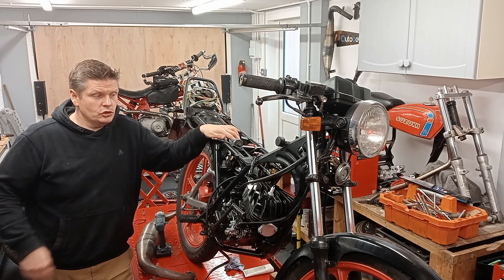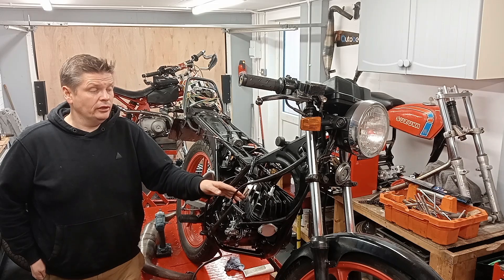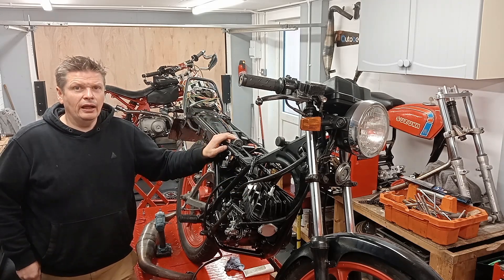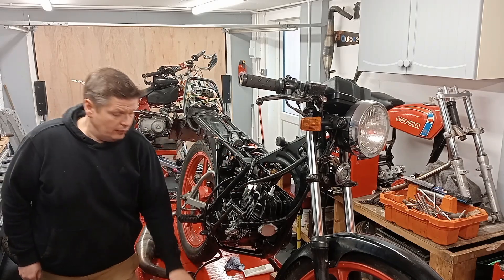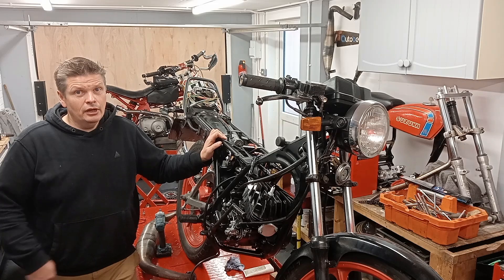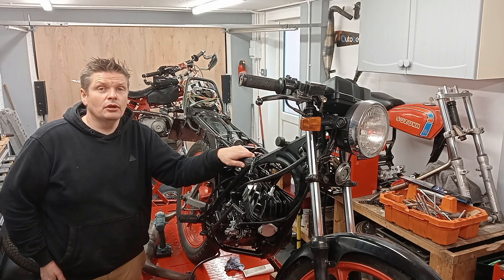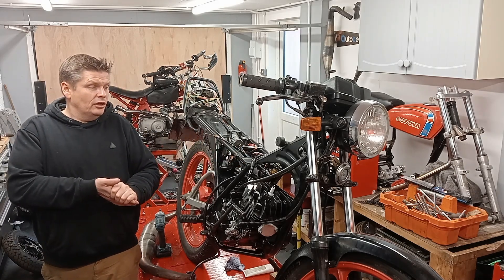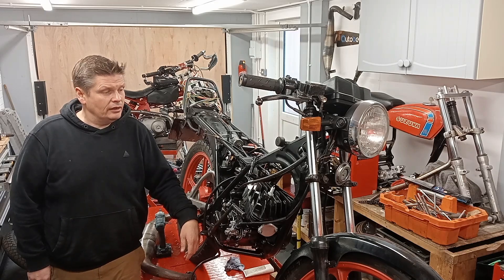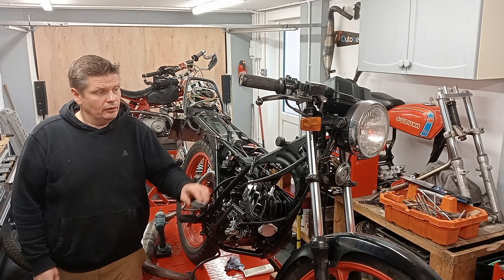Okay, outro. As you saw today we've made the leak down tester and we found some leaks. I'm still having issues — I think there's basically a fundamental design problem with the way I've gone about this first block, where the holes are so close they're communicating air all the way through, and it's proving really difficult. So I'm going to have to go back to the drawing board. However, on a positive note I have made a leak down tester which does actually show me the failings of my intake, which is good. Next time, hopefully I'll have a new intake and it won't be leaking, and I may actually get to the dyno. My inexperience is showing through, but I'm not going to give up — I will get this to work, I will get it to dyno, and we will eventually get this to a hundred miles an hour.